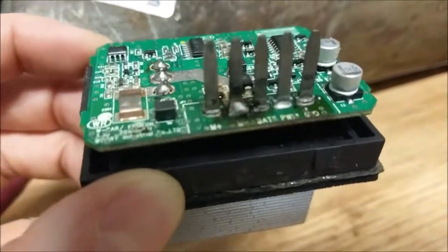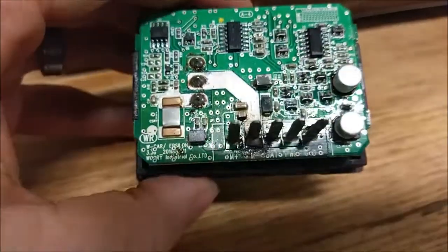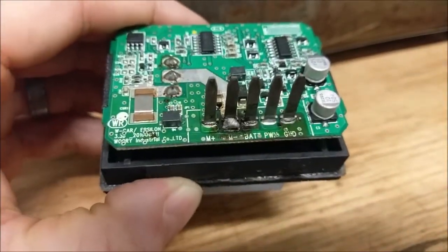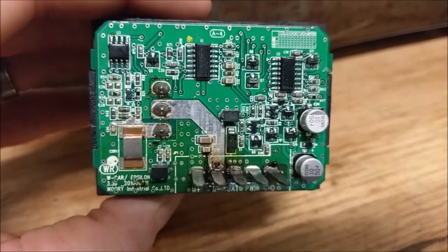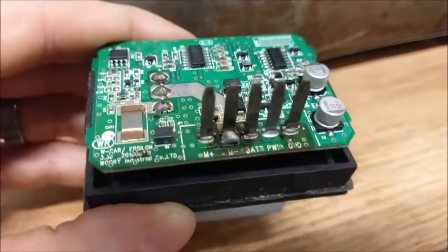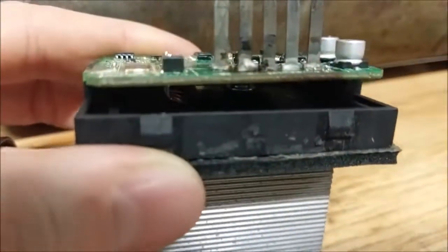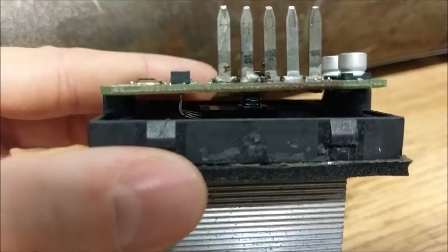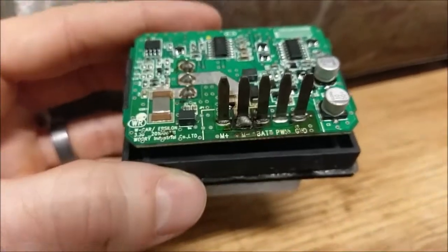So what I'm going to have to do is clean some of that up. Some people have their car start on fire because of this problem, or maybe not being able to run your front defrost would be a violation. The solder got displaced because of the heat. I'm going to clean this board up because of the intermittent operation, and I'm simply going to blame it on the connector body melting. On the bottom you can see there's an N-channel MOSFET, and this big aluminum chunk is the heat sink. The MOSFET seems to be working — it's probably about a one-dollar part.